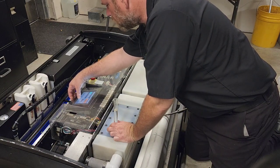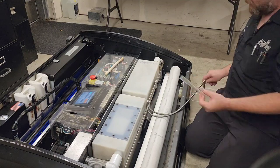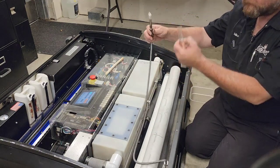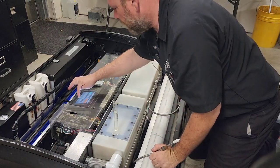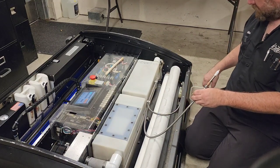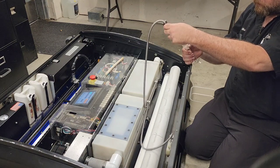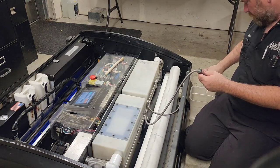So we're going to hit plus 10 on the bottom of the screen, 10 times. How about 12 times? That should be a good guess. Let's see if we get up to 25. Still a little short. We got up to 24. So we're gonna hit plus 10, 10 more times. How about 12? I'm okay if we go just a hair over 25. Not a lot, but just a tiny hair. Yep. We are just a teeny tiny hair over 25, so our water pump is calibrated.